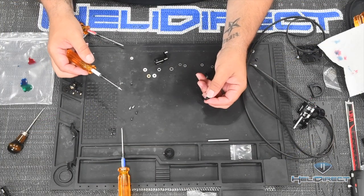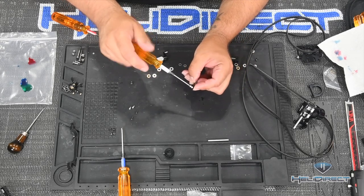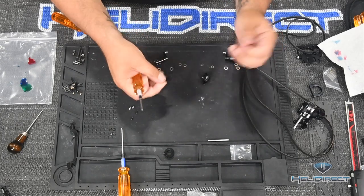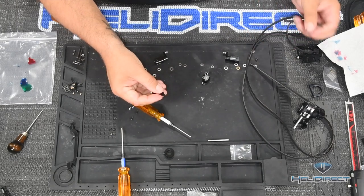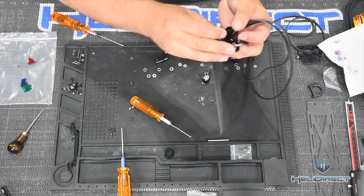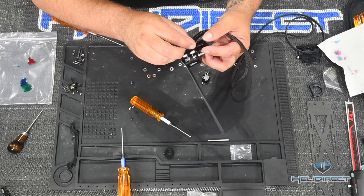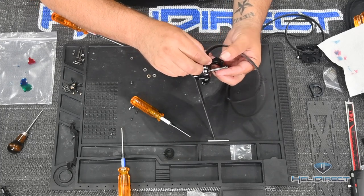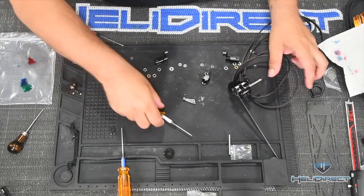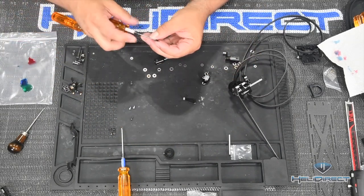All right, so now that we know where this servo ball is going to go, we'll take our control arm and just tighten that up again. We got a little bit of red on that. Our red Loctite, single point of failure theory. And then this side with the little raised bit is going to go in on top of our arm here, such that it goes this way, and it'll go in the holes sort of closer to the hinge line. And there are two bolts for that. Get some Loctite on those guys here. Again, we've got two points here, so blue Loctite's fine.